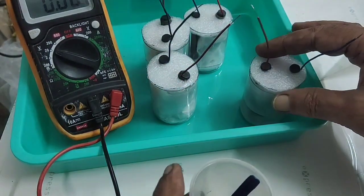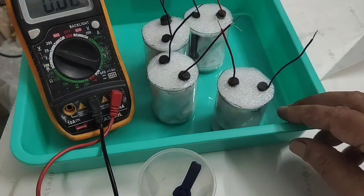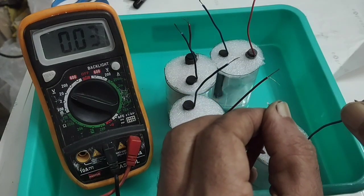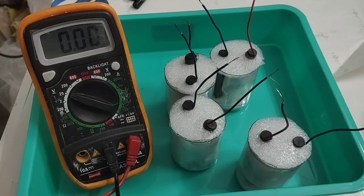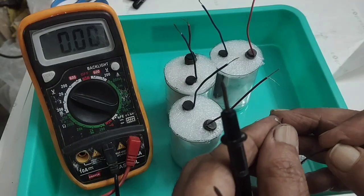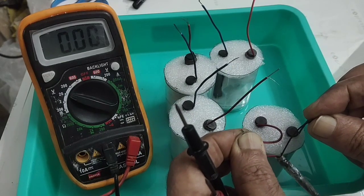This is more than enough. We have added to this cell. Let it get saturated. Being super-capacitors, there would not be any significant voltage — there will be only some small voltage. We are able to see no voltage. So we will charge it. Through external DC, I am going to supply 5 volt and 1 amp. Everything has to be wetted properly with this electrolyte.